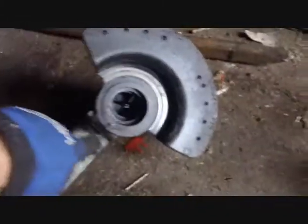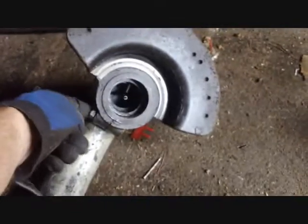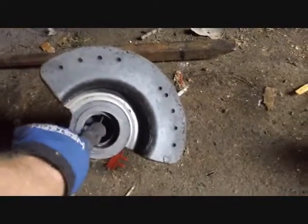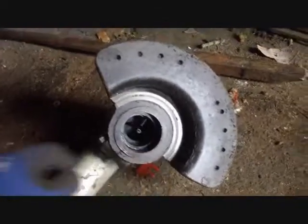I got that arm off. What's nice is that part kind of hangs on this bearing on the back, so you can get the screws out and it'll be partially supported, then give it a quick jerk and this bearing comes out. Now I see there's a tube here — I bet that's an oiler. You probably drip oil in there and it runs down that little tube and drips right into this bearing. That's kind of neat.